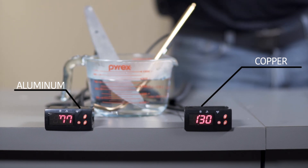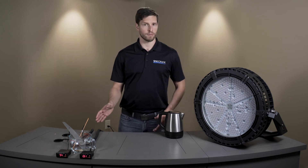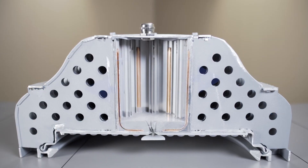What's important here is not only how high the temperature rose but how rapidly. Assume the heat from the water represents the heat from an LED fixture. What we demonstrated here is that copper is a significantly better conductor of heat than die-casting. We have designed and engineered it into a superior heat sink for our ProSpec Luminaire. This begs the question: if copper is such an excellent conductor of heat, then why are most manufacturers using die-cast? Is it because it's inexpensive? All spec-grade LED fixtures are given the highest level of thermal management engineering.